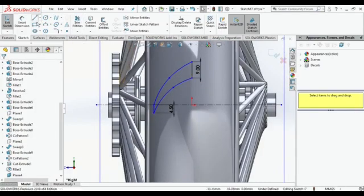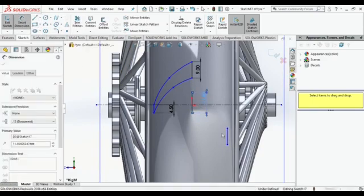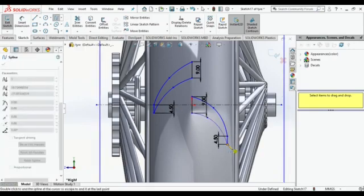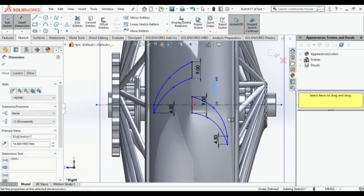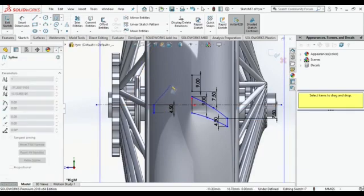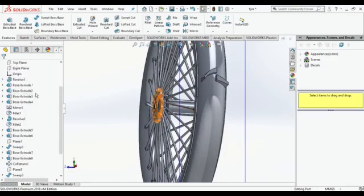You know that in the tire the rubbers come out over there. Think that the shape looks like this, but it is up to you what you want to make. You want to make this kind of shape, or you want to make your own. That is up to you. This sketch, you can design whatever you like for the upper side of your tire. Distances and lengths are simple: 9 mm, 4.5, 7.5, only 3, and extrude it. You can see over there.